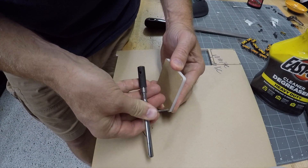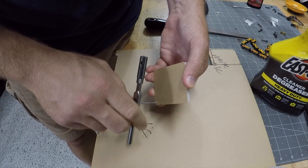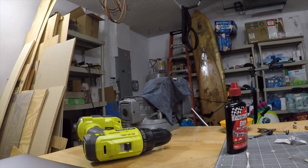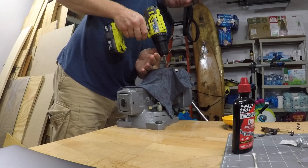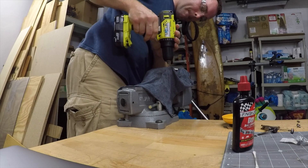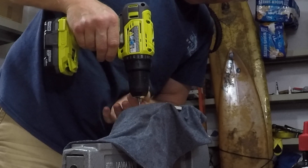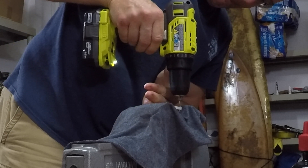With that done, I tried to tap the holes using a three millimeter tap — or what I thought was a three millimeter tap. But the standoffs, which are three millimeters each, for some reason did not screw in correctly, so it's more of a press fit at this point. I did use a hand drill for this because it's a whole lot faster. Even though I'm a little paranoid about breaking taps off, nothing happened, so maybe I'll use this more in the future.